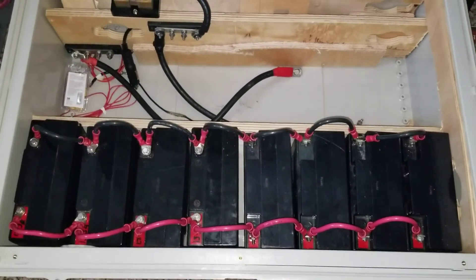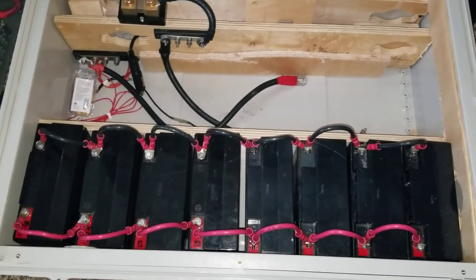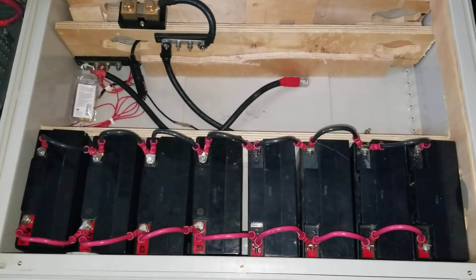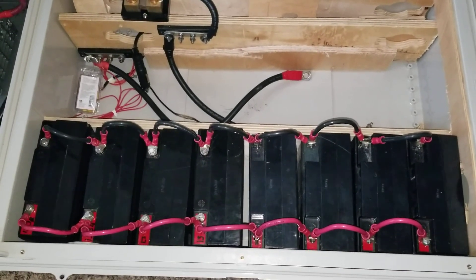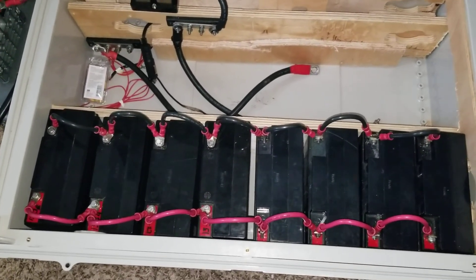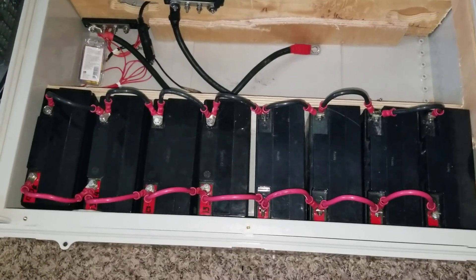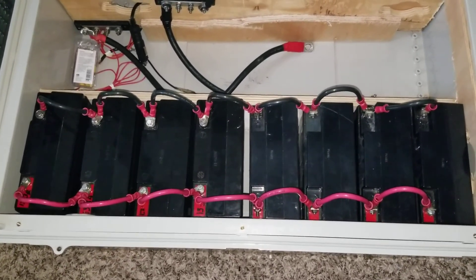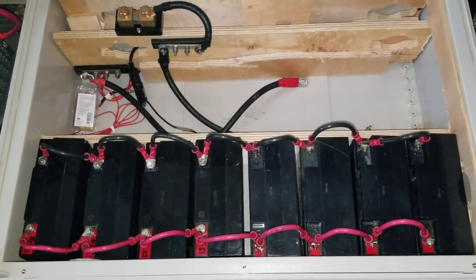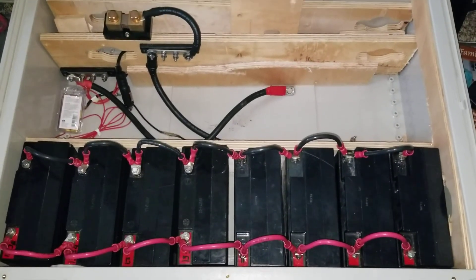So here's what we're going to do today: we're going to test the voltage of these batteries. They've been sitting for one year. Sometimes the shelf life of a battery — if not charged — maybe six months or so, the voltage starts sagging. But I want to show you how you store batteries. If you have a 12V, 24V, or 48V system, don't store them in that series configuration. Put them all back in parallel — positive to positive, negative to negative — and store them that way. They're going to last longer because the voltage and amps will be maintained and they'll stay well balanced.